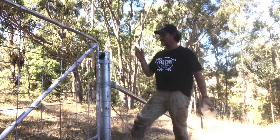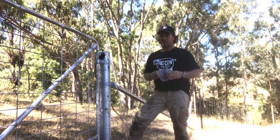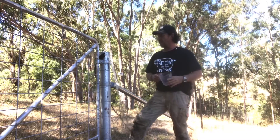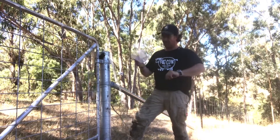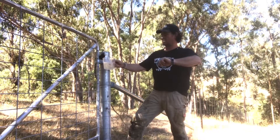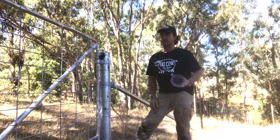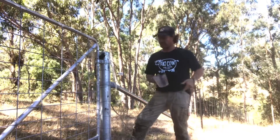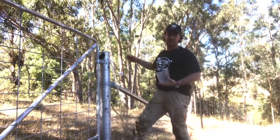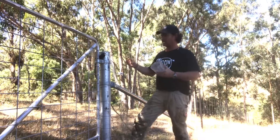Here we are — check it out! This is our 14-meter mark, which represents the top inlet of our header tank to feed the stock troughs on this side of Fat Cow Farm. I could already tell with the flow that it was going to be quite high. With my measuring cup: a full cup every 5 seconds — that's 12 liters a minute. That's already telling me I've got more coming out than I do coming into our spring water storage collection.